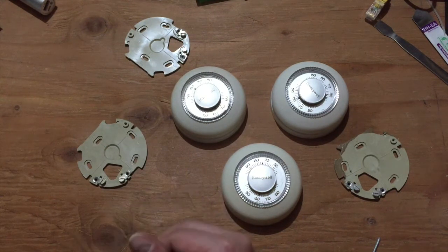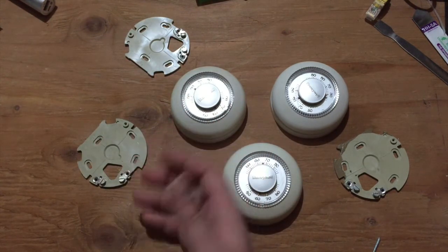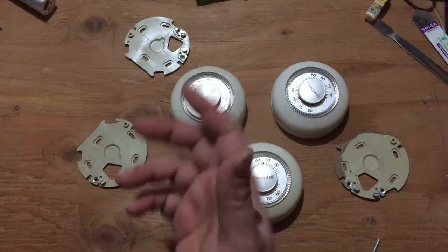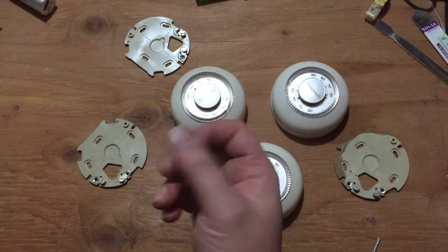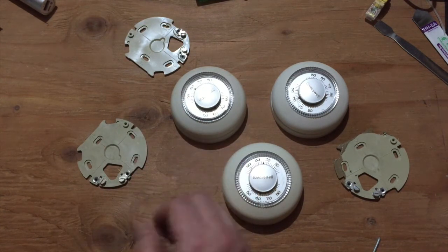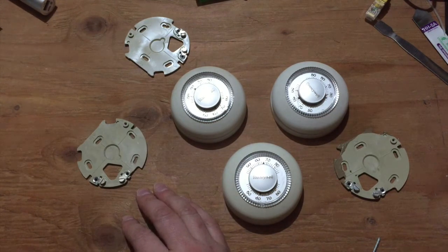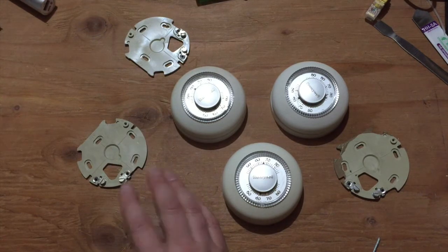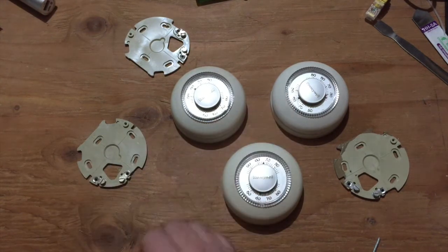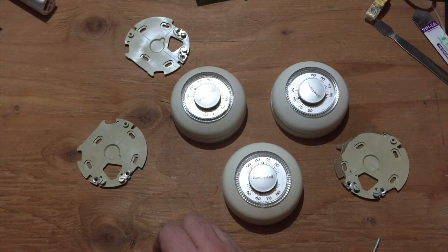That's not something that would apply to me here, because I'm just using heat only, and it's oil based. So the furnace consumes a little bit of electricity for just running the control system and for running the spark to ignite the oil and whatever. But it's really not consequential. But there are heat pump based heating systems, and some people have electric heat, so it may be offered up here. I don't know, but it is kind of interesting that they built that in, and really nice to just have the integrated functionality. They seem to have thought about it a lot.